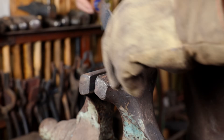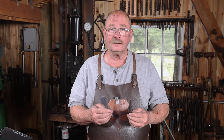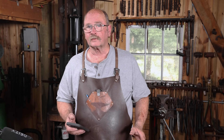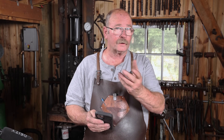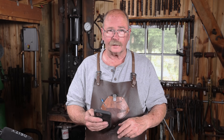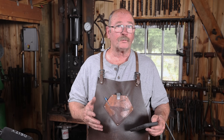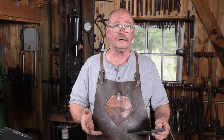My length on these came out almost identical — these are now ready to go ahead and harden. Usually I would say harden and temper, but the Atlantic 33 is a non-tempering steel. Still seems like magic to me. Doing a little more scrounging around on the internet, I found some information on cannonballforge.com — they're also a dealer of Atlantic 33, and I'll put a link to their website in the video description. They have a pretty good variety, and they also have it in hexagonal bar, which might be nice to work with — then you wouldn't have to forge those flutes out initially.